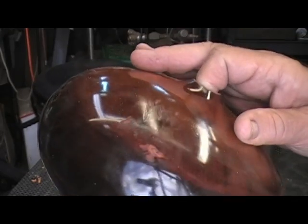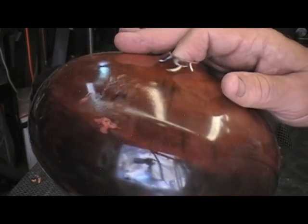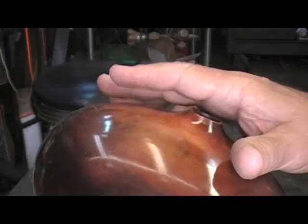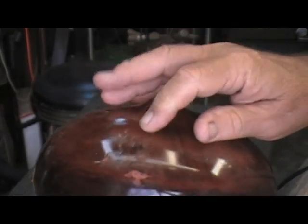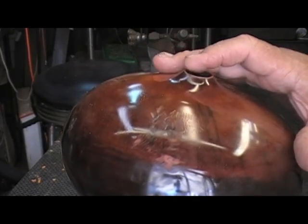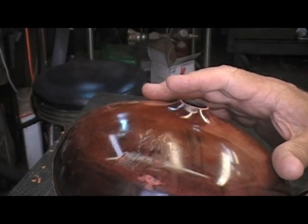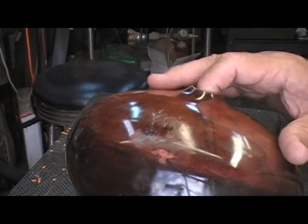I had shine juice on it. I went back to see just how bad I burned it and marked it up even more. I wrinkled out the finish. Look how good it was over here and all the way through the bottom - it was really a nice piece. I even concealed that joint in the center very well. But that was a killer. If I'd waited another day or so and been easier on the piece, it heated up the finish and it rolled. It is shellac, it is shine juice, and I didn't top it with anything. So I broke almost every rule to make it fail.